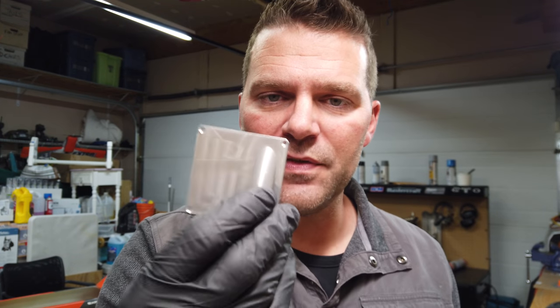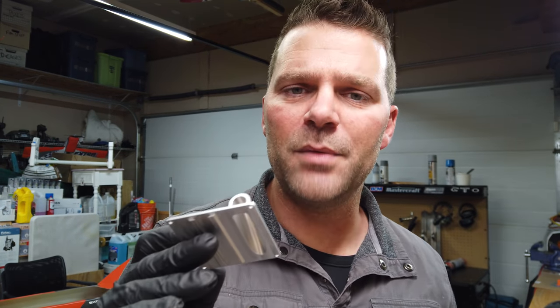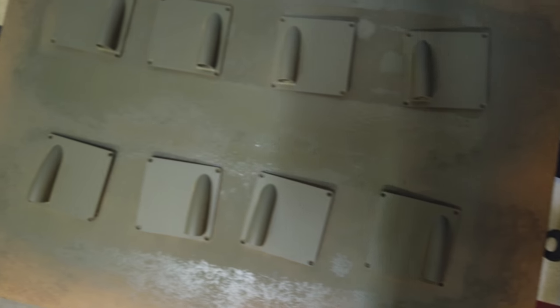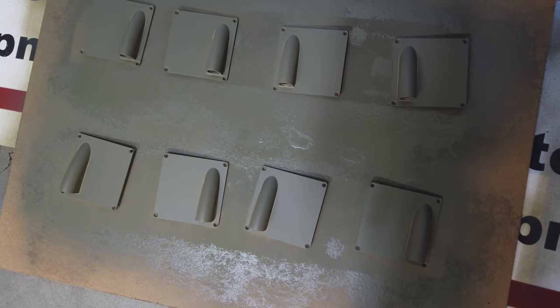The last thing I'm going to do in this video is paint the servo hatches. These are machined out of a single piece of aluminum with nice little channels on the back and servo mounts that slide into the slots — really slick setup. To paint something like this properly, first you need to etch it with primer. What I've done is go through with the acetone and clean them up. I'm painting the surface and making sure I get the edges as well, since you'll be able to see the edges when installed. There are now two layers of self-etching primer on there — went on nice and smooth and clean. Going to let that sit for 30 minutes as recommended, then do a layer of color tonight.